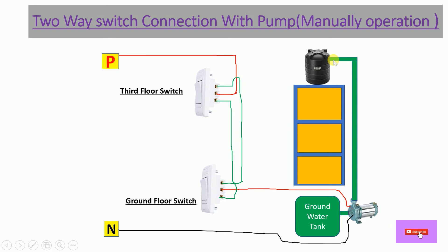I have already completed the two-way switch wiring with this pump, since we covered the wiring method in the previous application. We have one two-way switch at the ground floor and one at the third floor. The phase is given to the Common terminal, L1 to L1 and L2 to L2 are connected between both switches. The output Common of the ground floor switch provides the phase wire to the pump, and neutral is connected separately.